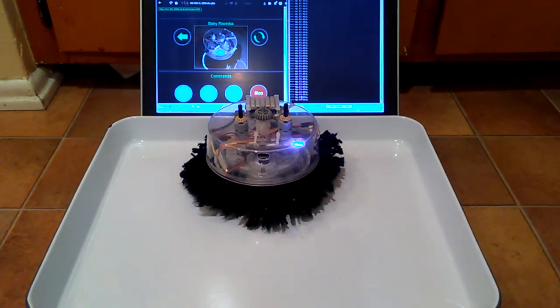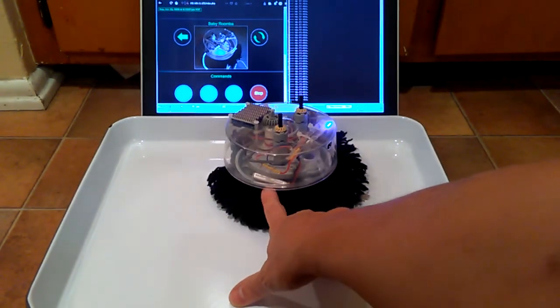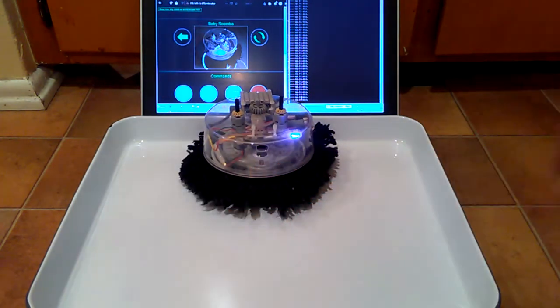Now in the future, if I wanted to make it easier, what I would probably do is start with a Raspberry Pi Zero W, maybe get a bigger battery than the 650 milliamps so it stays alive longer, and maybe some kind of accelerometer or some kind of multiple axis circuit to see if I can figure out where it's located. Because if I know where it's located, I'd like it, if it really gets stuck, to try to figure out some kind of strategy to extricate itself.